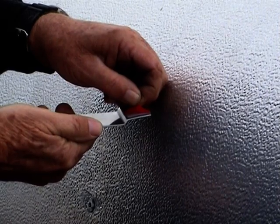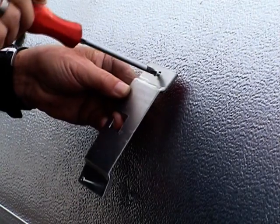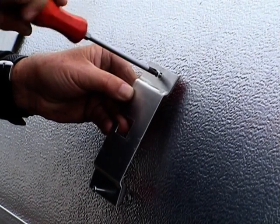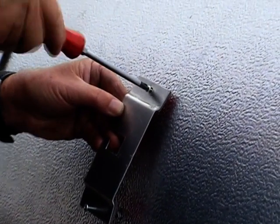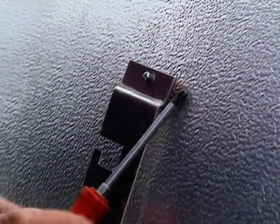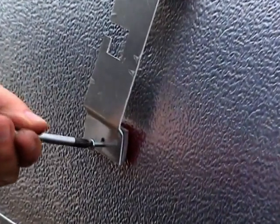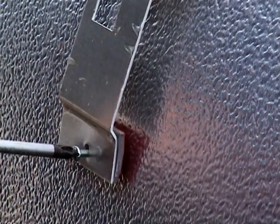Before placing the mounting bracket in position, remove the red strip from the back of the adhesive tape and place the hollow wall anchor screws through the washers and then the holes in the mounting bracket. Line up the two screws with the two hollow wall anchor inserts in the tank and start both screw threads before pressing the mounting brackets into position. Tighten the screws.